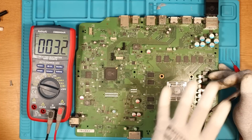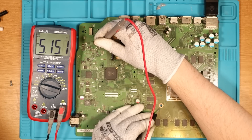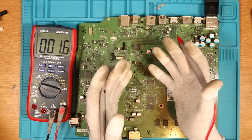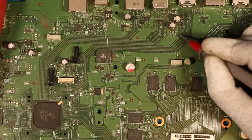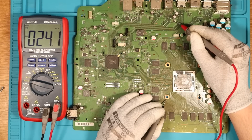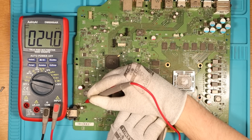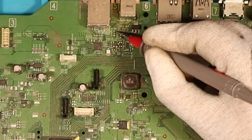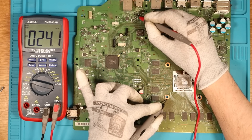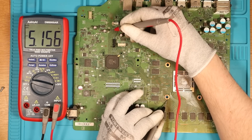Putting the multimeter into voltage mode: I can see 1.8 volts, 3.3 volts, 5 volts on the five-volt line, and 1.1 volts. What I've noticed is on these components — I don't know if they're fuses or resistors — I'm supposed to be drawing five volts, but I'm getting millivolts when I measure either side. This little component with a C on it is also meant to be drawing five volts but the multimeter shows 24 millivolts. We'll be at five volts on the test point — very confused.